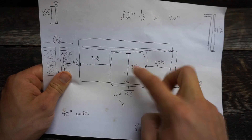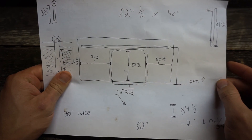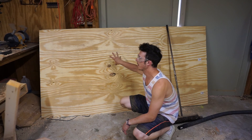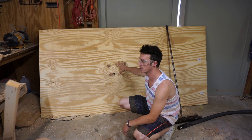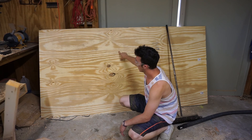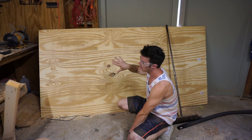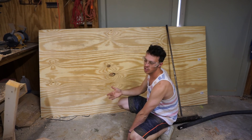Okay, so here's the sliding doors — split in two. This is the amount of room I have on each side of the door: 40 inches wide each, so they'll fit on either side. I'm gonna make a backing out of half-inch plywood — it's a little less than half inch, like 15/32nds, whatever that means — and I'm gonna make a template 40 inches by 82 and a half inches, that way all my boards will be able to stick on that, and I can decide to put a trim on it later to cover the edges of the plywood.